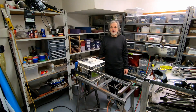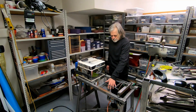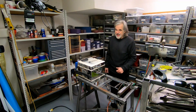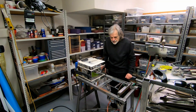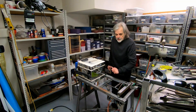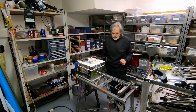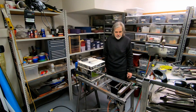I'm continuing development of my chip stack assembly kiln apparatus, and I've added a couple of things and changed a couple of things. In the previous design, I had an insulating block down here to try to prevent heat loss from the plate, and that really didn't work very well. So now I've rejiggered the thing around and modified some stuff and welded up some stuff, and now I have a Bunsen under the plate, which hopefully will keep a little bit of the heat loss under control and possibly make the thing recover temperature a little bit faster when I stick it back in.